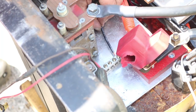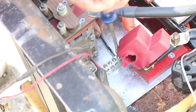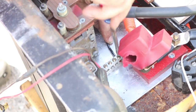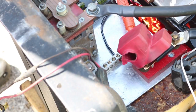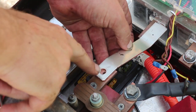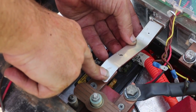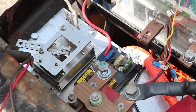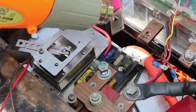The circuit is completed by the negative 12-volt black wire down to the bus bar. Since this is all metal, this also grounds the rest of the system on the 12-volt negative — I just need to snug that down tight. Coming back to the bus bar, I gave it a couple of bends, reusing the one hole already in it. I got the bends to match the height pretty well, just need to mark and drill a hole for the other end. After that I put some red heavy-duty heat shrink over it and used the heat gun to shrink it down.